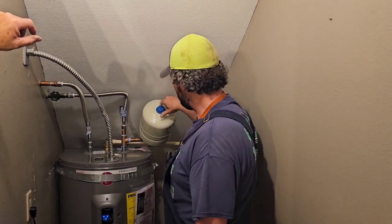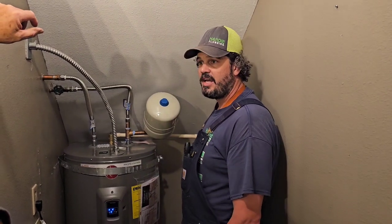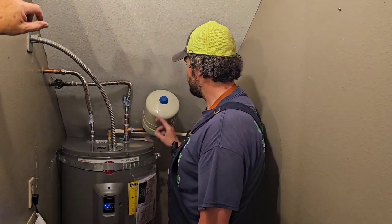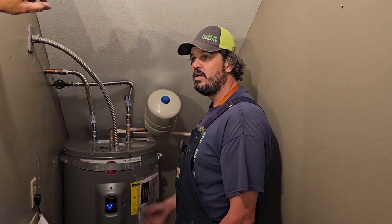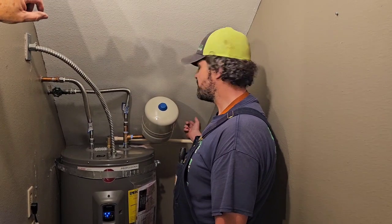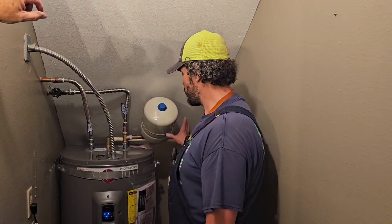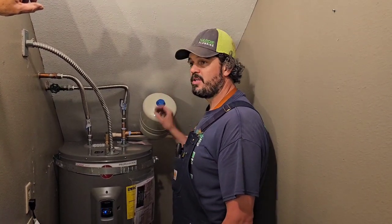I see. But one of these years, you're going to hit that, and water's going to come out at you. And it's not that it's losing air; it's going to be popped. You're on the City of Tacoma water system, and they do chlorinate their water, and chlorine does attack rubber. It's about 3 to 5 years. This is going to be your first component that's just not helping you anymore. It's not going to leak. It's a pressure vessel, but it's not going to be doing its job anymore either.